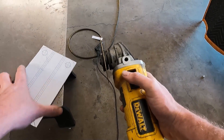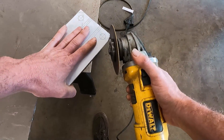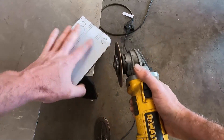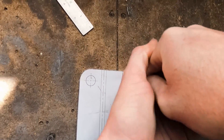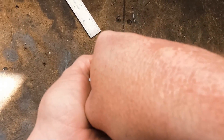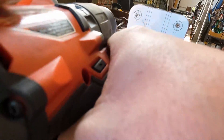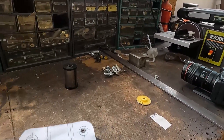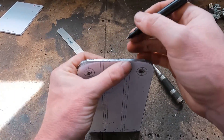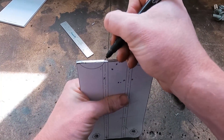After cutting the part out, my next step is always to cut the corners off to save a little bit of time on the belt sander later. For our hole drilling portion we're going to need a center punch and drill bits. If you don't have one of these auto center punches, you can use a standard punch or even a nail and a hammer — just make sure you get your marks lined up so your holes line up or the part isn't going to work. I like to get these holes marked before I do anything else in case my paper comes off or shifts. I also mark the bend lines on the edges of the sheet metal just in case the template lifts.